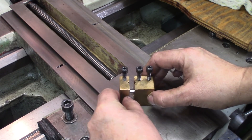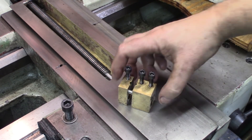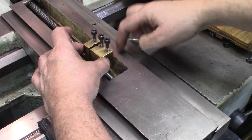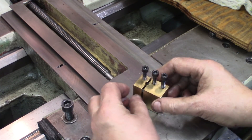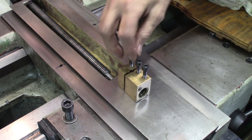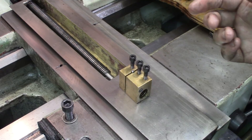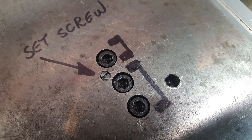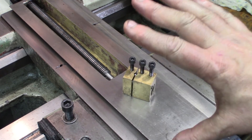This is to show the detail of the split nut. This split nut goes onto this long screw there that links the cross slide to the carriage. This is adjustable to make up for backlash. The principle of how the adjustment there is done: those two screws — let's say you fix them. After that, Philip's going to install the bearing inside of this. There's a little groove there, and onto the cross slide you've got a screw that will push onto the bearing there to make the adjustment possible between the two nuts. So you eliminate the backlash on this.